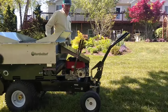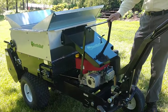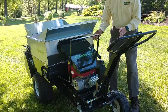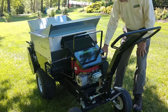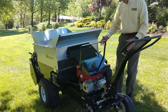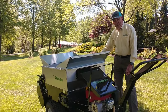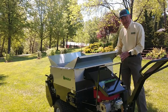Let's talk a little bit about the unit to give you some understanding of how it's built. The hopper is stainless steel and it uses a belt system inside. It's got a ten and a half horsepower engine connected to a ToughTorque transmission — the largest transmission ToughTorque makes before you go into your compact tractor series. The engine runs the transmission, the transmission runs the ground wheel, and the ground wheel has hubs with sprockets. That hub-sprocket system drives a chain going up to run both the conveyor belt and the brush, meaning the unit is driven off of ground speed.